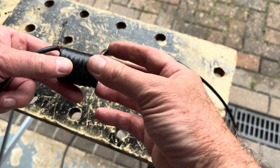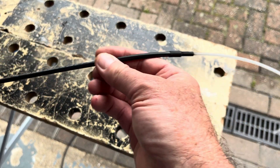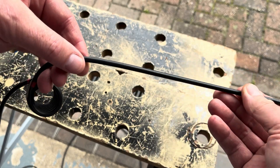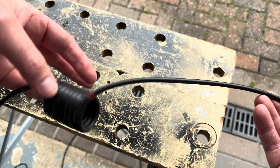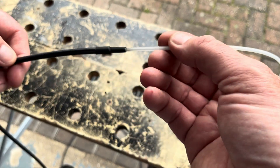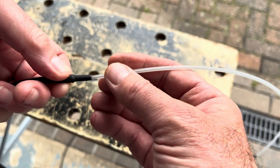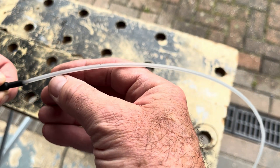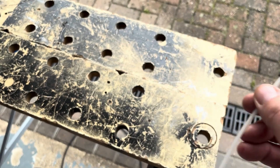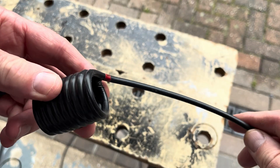In practice, here's the coil — we'll come onto that in a second. This is the bottom run of coax. The RF is going to come down the outside of the braid and get stopped at that coil, with no RF going to the radio below it. Here the braid has been carefully cut away leaving the centre wire still inside, and that is terminated. It's weather sealed at the top and weather sealed there — that's effectively what the diagram looks like in reality.